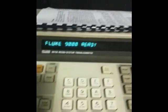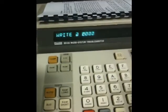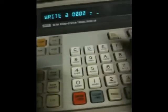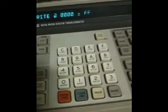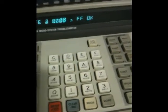If I come back here and try to do a write — I'm going to hit write and write at 0000, since it's the beginning of the RAM. Enter. I'll just write two Fs and hit enter. In a normal scenario, this would actually be no lights, and it would look exactly the way it was if this thing was truly working.